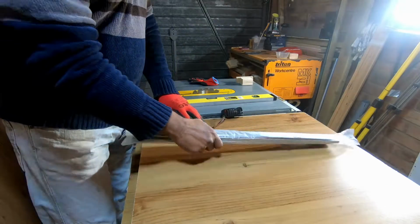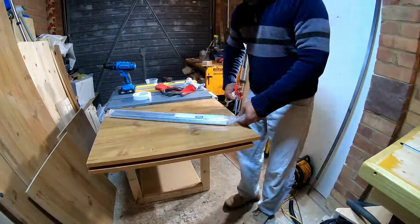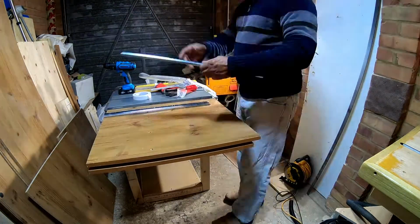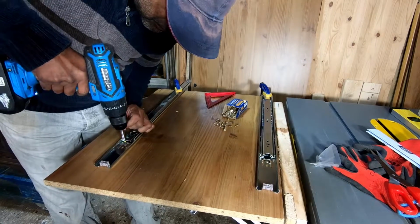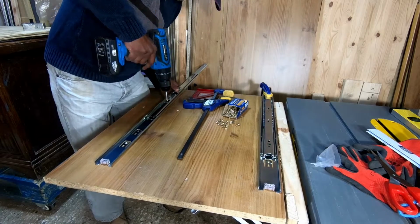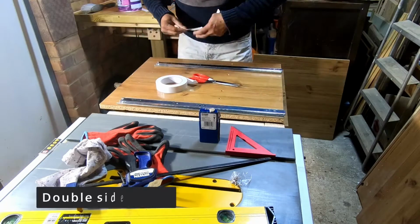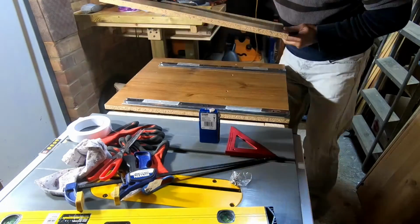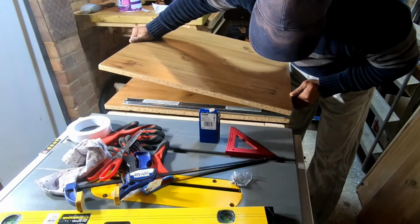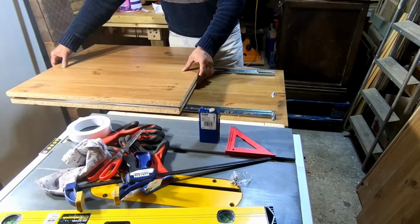With some renewed energy, I figured out that the best option is to have an opposite pair of drawer runners which runs in the opposite direction. So with that, you could move the entire assembly backwards as before, but then it can fully slide forwards, which will give us the clearance that we are looking for. And now you can see how this entire assembly is going to work.